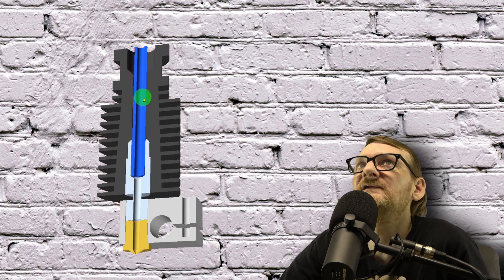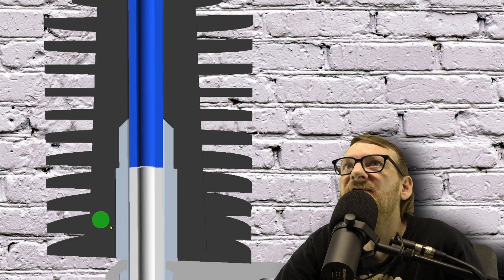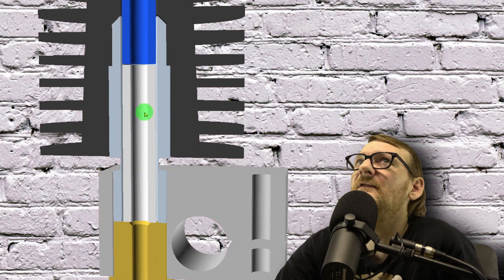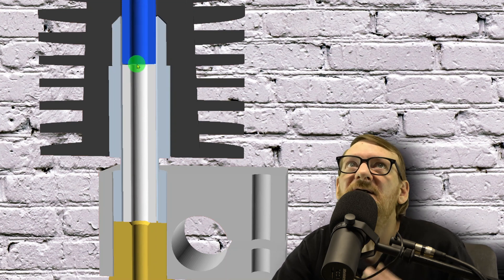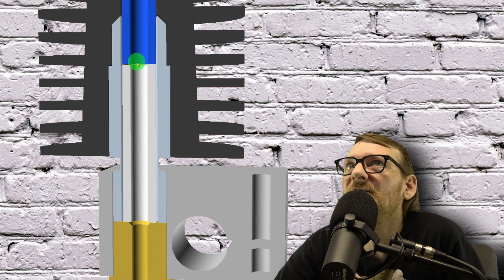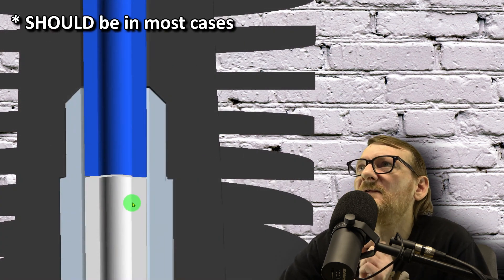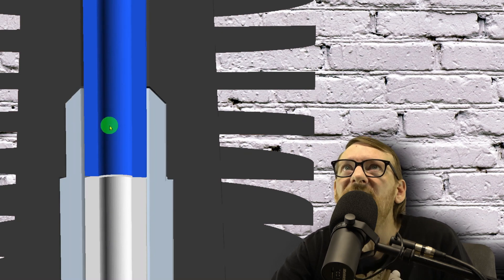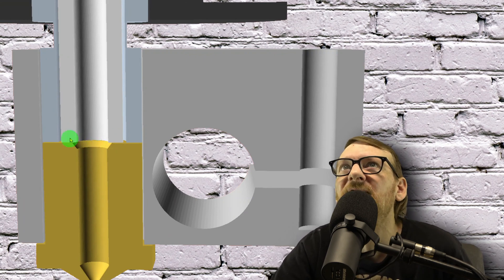Let's look at the entire path through the hot end. With the all-metal variation, your bowden tube — which is a PTFE tube — meets up with the metal throat. There is a gap right here and it's a common place for softened filament to suddenly cool and expand, causing a jam. With the PTFE version, the molten filament when retracted goes into the PTFE, and by the time it reaches the gap between that PTFE and your bowden tube it should be fully solidified and quite smooth. Thanks to Teflon's own smoothness, it will not grab onto the PTFE inner wall — it'll simply slide right out. And since the diameter of the PTFE hot end is slightly smaller than that of your bowden tube, this all but eliminates the possibility of a filament jam at that specific point. Where the PTFE meets the nozzle there's a tiny gap as well, however since it's at temperature while printing it's not going to solidify there.